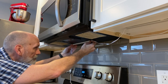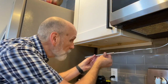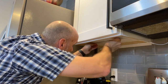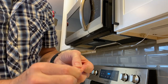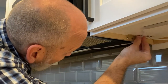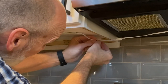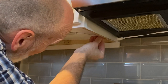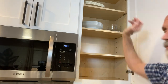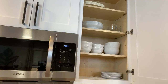Some people might say not to put lights under your microwave or over your stove, but I did my research and found it should not be a problem. Just to be safe, I positioned the center light closer to the back near the wall to avoid any risk of melting the light or cables. I'm also using the included cable clips to keep the cables from sagging and going in the direction I want. There are also cable channels available — I'll put a link in the description.